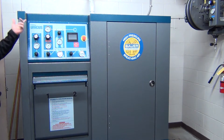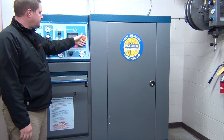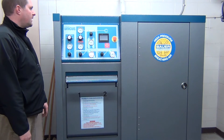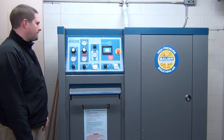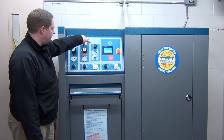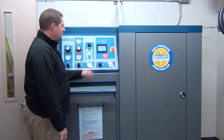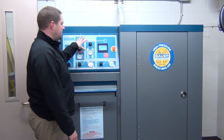This morning when I got here, I went and turned on your big breaker in the breaker box — that one was already on — then I came over here and turned on your compressor. What it'll do is a little warm-up and come to the main screen. If you follow these lines it shows you what's happening — it comes over here and goes to fill your cylinders, or directly fill to your tanks you put in here. Here's your main screen — it tells you when it was last running and what your final pressure is. It'll actually read live pressure to you.